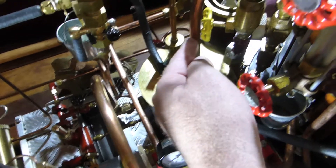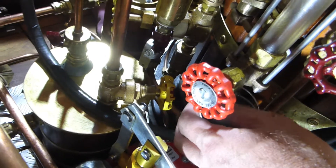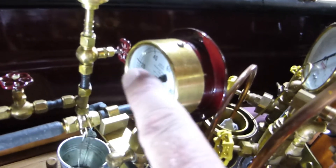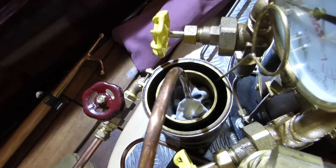The cooled exhaust here after condensation goes up this pipe into the stack and leaves at the top. In order to measure the back pressure, I have a manometer installed in the line to the condenser. With the valve here I can adjust it so that at a certain back pressure, this manometer shows that the condenser is full of water. Then I have to open this valve, and the condensate overflow goes into a self-made oil separator.